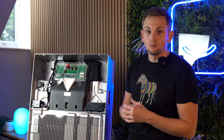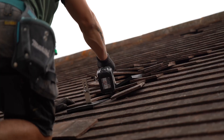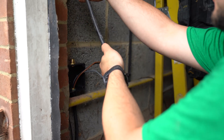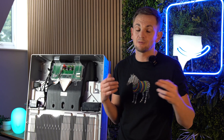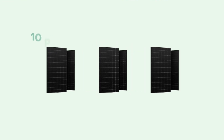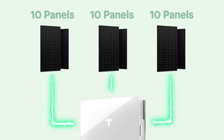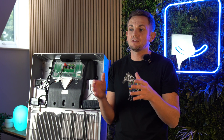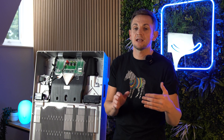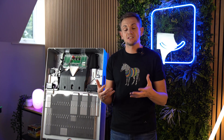So how would you DC couple a Powerwall? You take your solar panels on the roof, string them up to the appropriate number, and run those DC cables off the roof straight into the Powerwall. You can have up to three strings — maybe 30 panels, 10 per string. Or if you've got an east-west roof with a small south array, you split them so you're always keeping the same orientation on the same string.